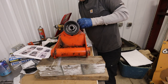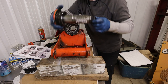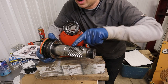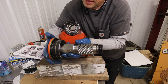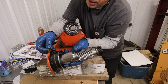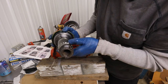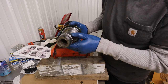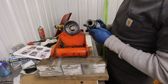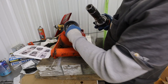Okay. That's what this guy looks like. So this is what they call the shaft. It's got this series of helical gears right here. It's got these two piston seals, and here's our O-ring that started to extrude out. There's a groove there for it, and that started to extrude out, and that's where I had oil coming out. And we can see on here the timing marks that I put in there. It doesn't look like I'll be able to see far enough in here to make marks up in there. So we may just have to trial and error it to get this to reference into that.